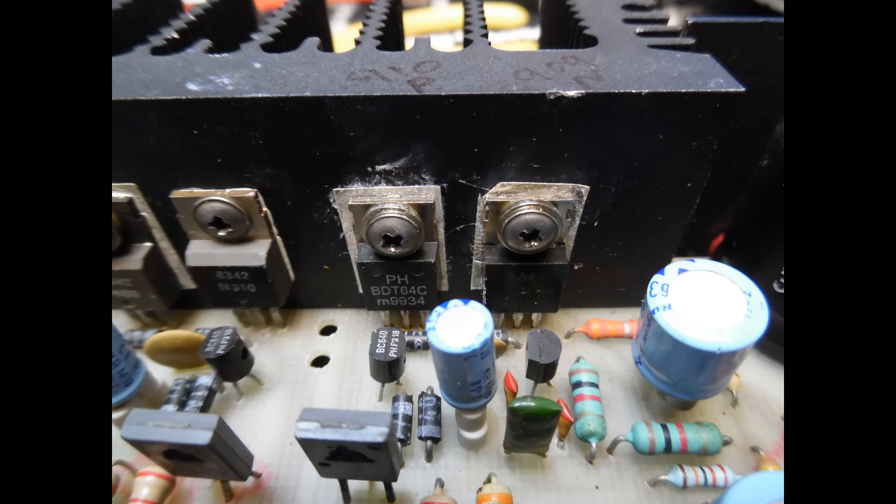Always use a dim bulb tester when doing repair work — I'll put a link in the description. Replacing the fuse and powering up confirmed the orientation was wrong. To access the board, pull off the front control knobs, turn the amplifier over, and release three machine screws. Then use a small adjustable spanner — not long nose pliers — to release the locking nut on the headphone socket. Squeeze the plastic pillar mounts and lift up the amplifier board. Underneath the board you can clearly see someone has fitted a wire link, presumably because pushing in the transistor pushed away some of the circuit track.